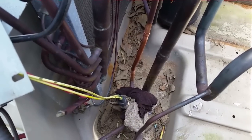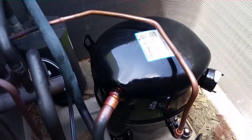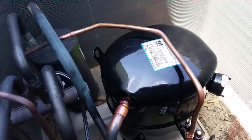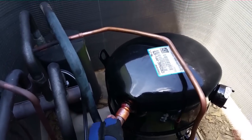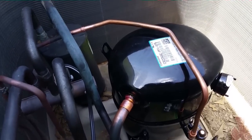I'm putting in a piece of 3/8 copper to replace where the dryer was, and I'll place the dryer outside. I want to get this in place before the compressor goes in — it'll be a little easier to braze with that done. The replacement is a Copeland for the Bristol; the piping is a little different so I turned it 90 degrees and made a couple of bends to meet up the hot discharge line and the suction gas line. It ended up pretty good. I'm going to solder this up flowing nitrogen and then put the dryer in outside the unit.